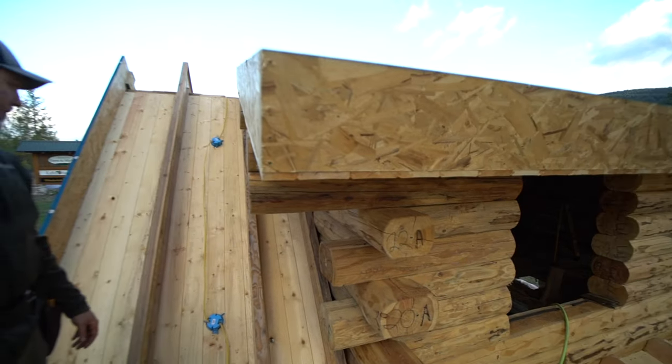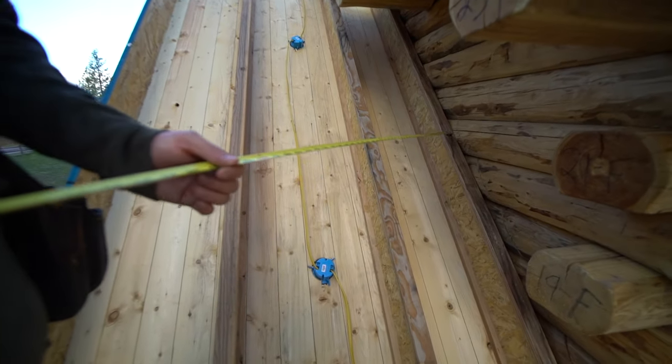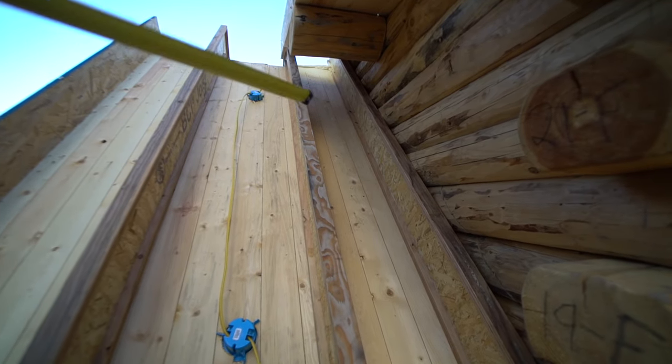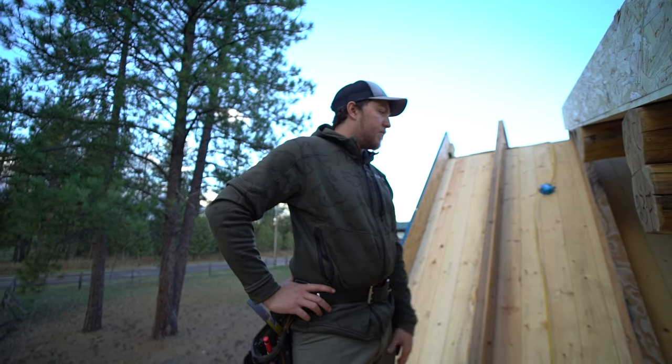And here along the wall, we're just gonna get it fairly close. There's a groove here that will accept some flashing later on for the roofing. So that's pretty straightforward. Just run the plywood up against that and be good to go.